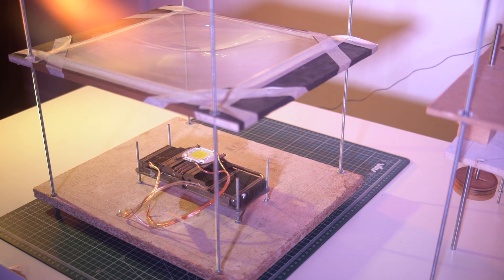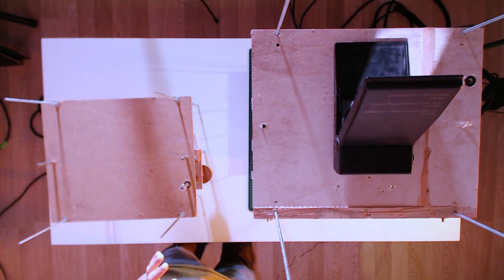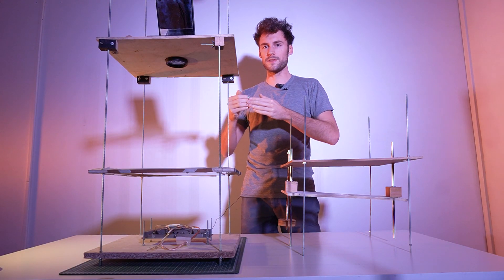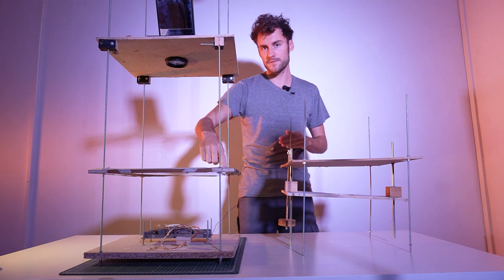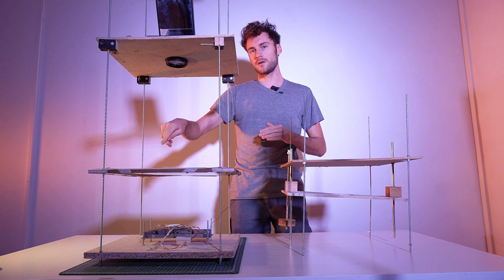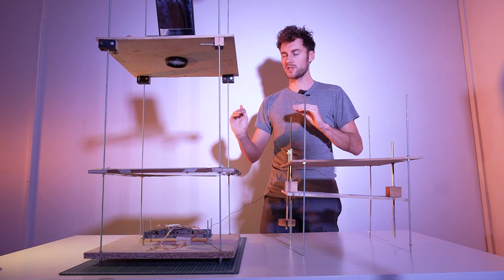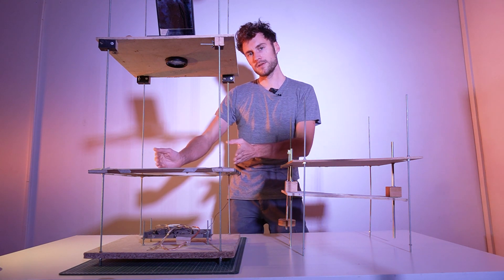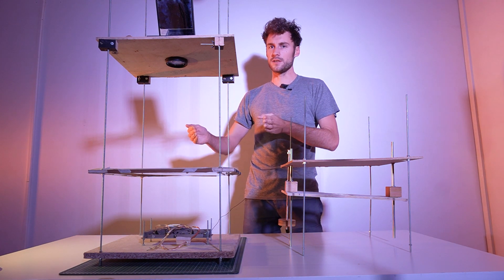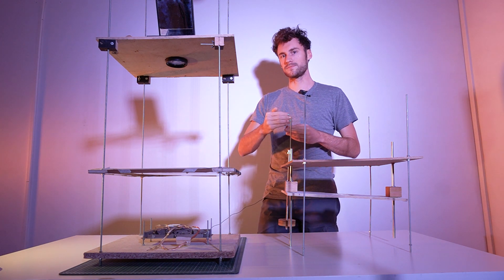We also thought about the size between the 3D drawers. We started with standard dimensions, but it could be larger or smaller — never smaller than the standard size of the Fresnel lens and the square of glass, since those dimensions are always roughly the same. We made a reference document with every dimension. We're thinking about making it a little larger, but never more than 40 centimeters, as that's the standard in industry — meaning you can put six of this model on a standard palette of wood.